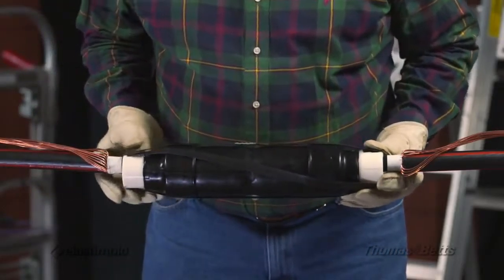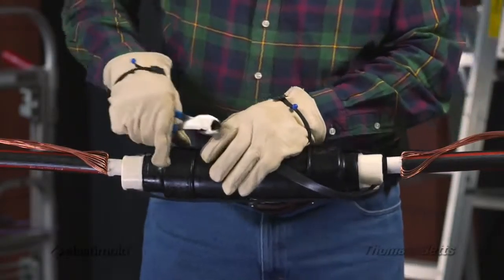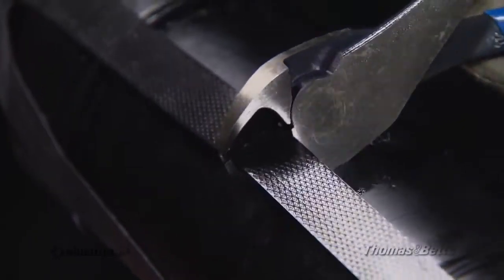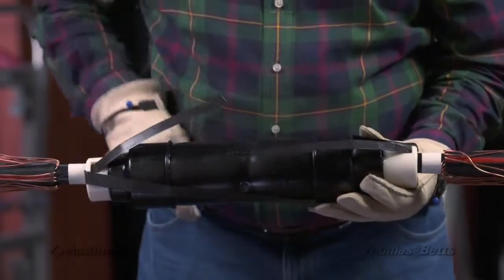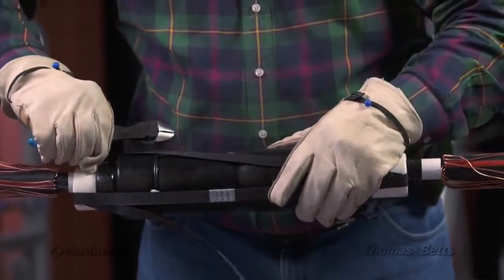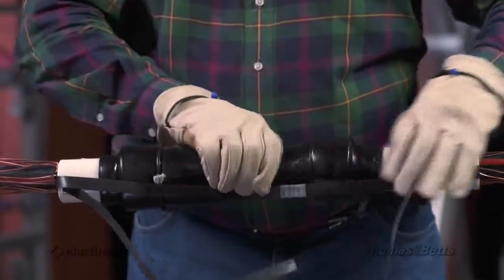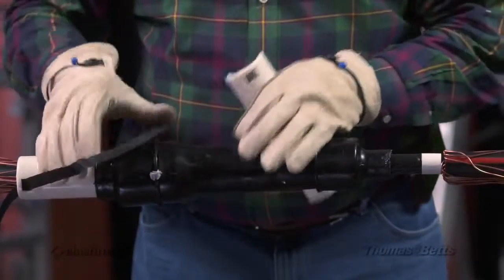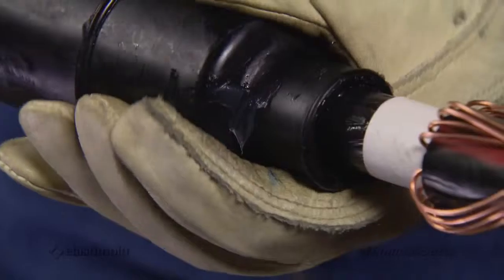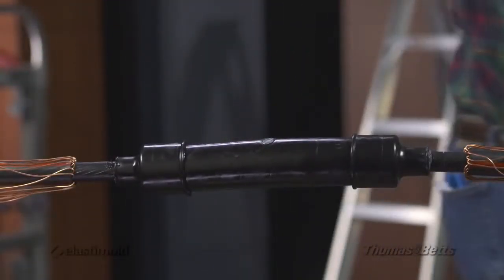Position the joint up on cores over the connector and in between the tape markers. Cut the bands holding the cores into the splice body. Squeeze the joint body in the middle. If required, hook the T-handle tool into the slots at the end of the core and hold the joint body while pulling on the cores to expel them. Once both cores are expelled, the joint body needs to be centered between both tape markers. Remove the tape markers from the semiconducting shield of the cable.